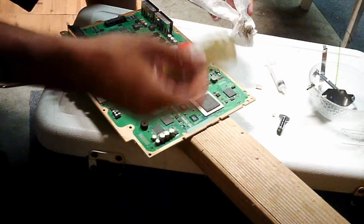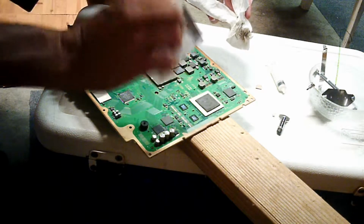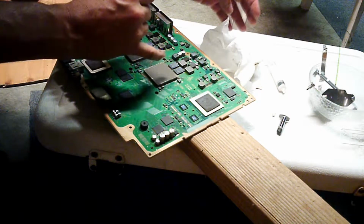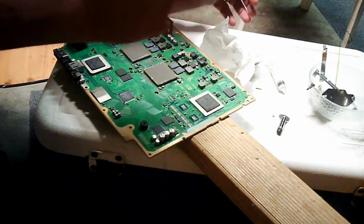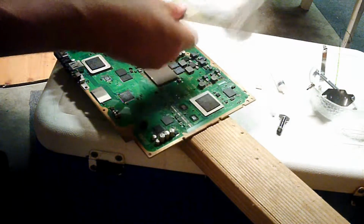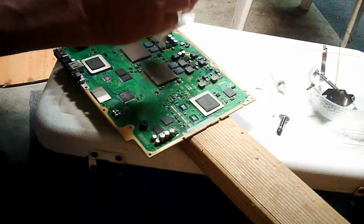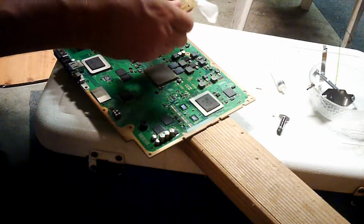That's it. If you want to put it on the other side with your credit card onto the fan, can you get away with it? Yes. The preferred method is to put a big X or a blob in the middle and let the fan itself, the fan's sink unit, squish it down into a flat film. And that's the way it's supposed to be done. We're going to wipe this one off, and then I'm going to continue on with showing you how to reassemble this thing.